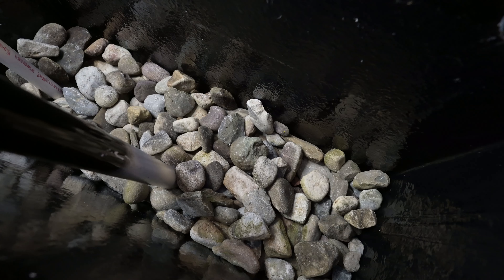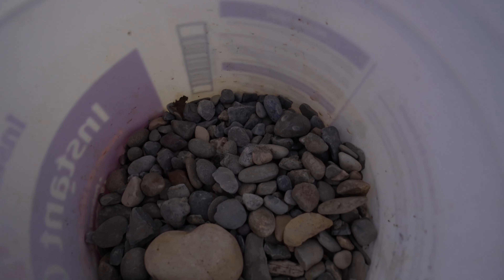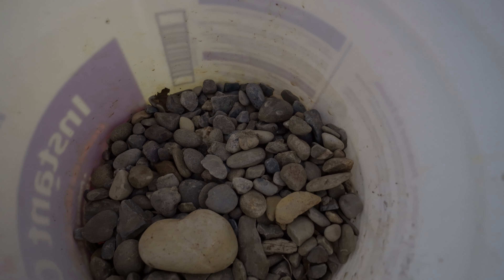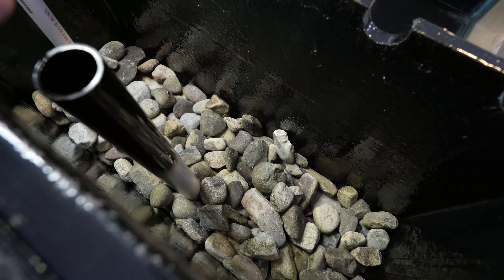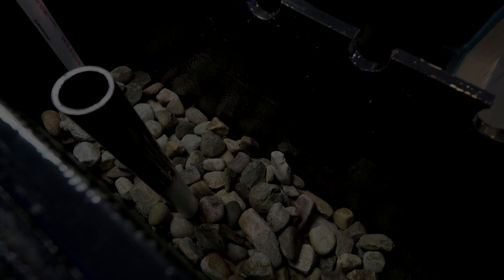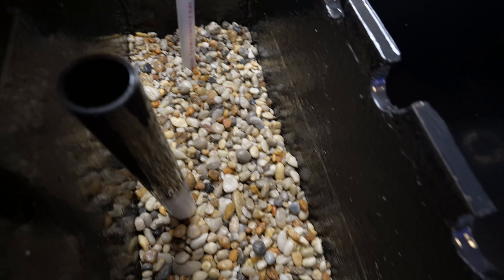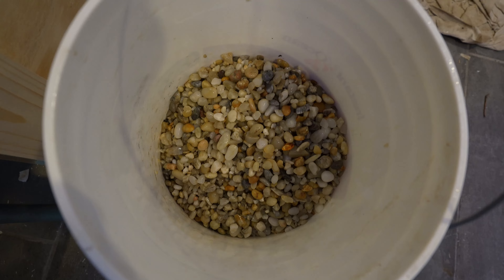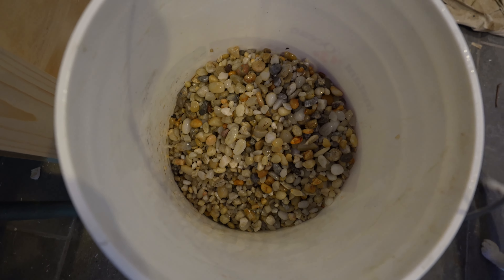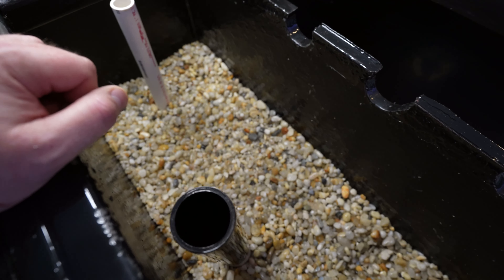The first layer of larger stones - the largest aggregate - is in place at the bottom of the filter. Next is the medium layer: smaller river jacks around three-quarter to one inch diameter. After that comes pea gravel - something with the consistency of aquarium gravel. So we've got larger rocks on the bottom, medium in the middle, and now we're adding the pea gravel for the top - this is where the wetland plants will be planted. We want a few inches of this to hold them up.